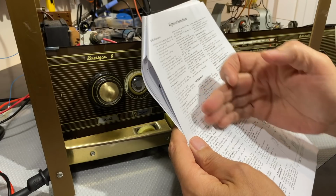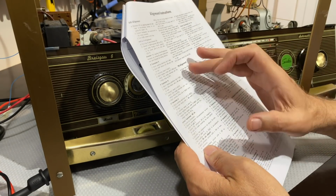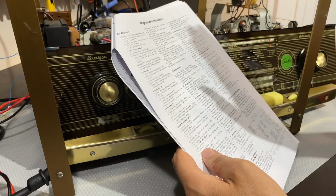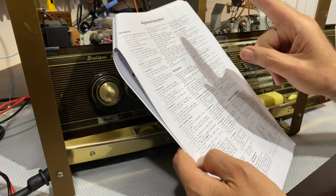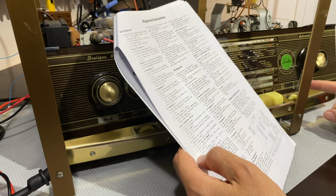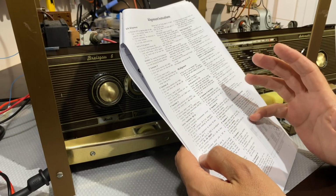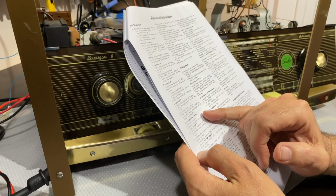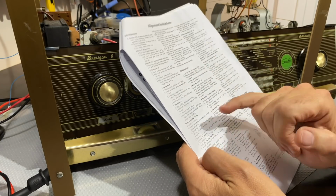We are continuing on from here. So I presume that what we're doing is we've got negative 4.5 volts on the AGC, so I'm going to put that on. We've also got the signal generator pumping 460 kilohertz into the grid of the ECH81. That's where we basically left off here, and I don't see why we would change that. We've got an audio tone that's modulating that carrier, which is a 30% modulation. So far so good, and now we get to this point.